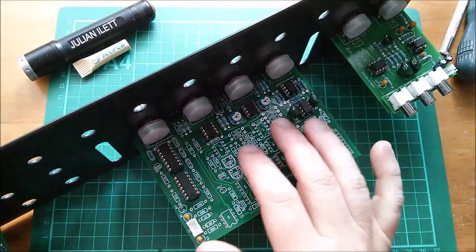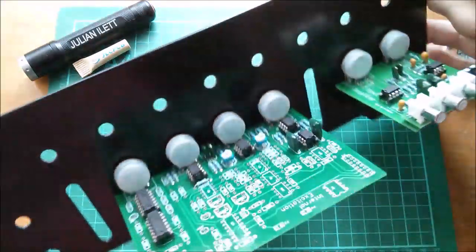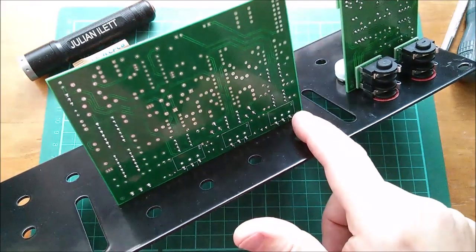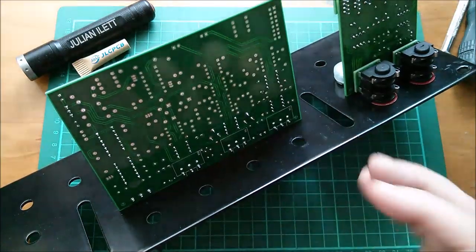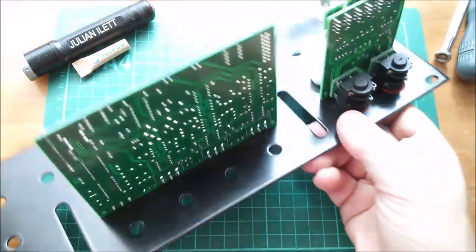Today I want to do a bit more assembly on the excitation board. I've got one of the oscillators running. The problem with getting the second one running is that the pots for it are underneath, and I don't have a clearly thought out method of getting the pots linked onto the underside pads yet. It really needs daughter boards, but I'm not sure whether I want to go to that trouble or just run little wires across.